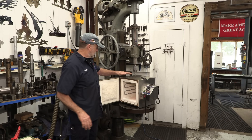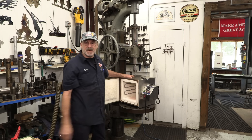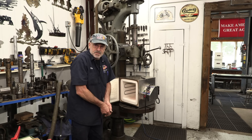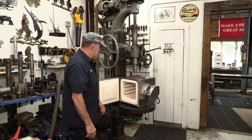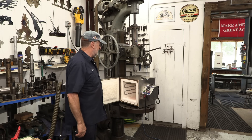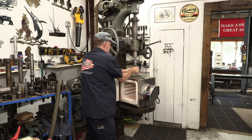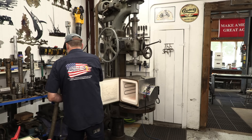We lucked out that the rubber pads for the oven sit on the drill press table, and what a better way to make sure we have a good 90-degree hole through the top of the oven. I remember back in the day when drills had a level bubble or center plumb bob — they don't do that anymore. None of my battery-operated ones have that feature. I've located the center of our hole and we're going to go in with a quarter-inch, bring this up and take out our centering piece. We're only going through two inches of material here, so that should be fine.